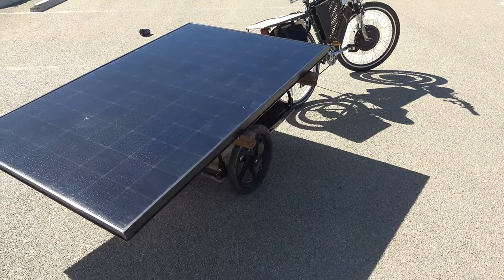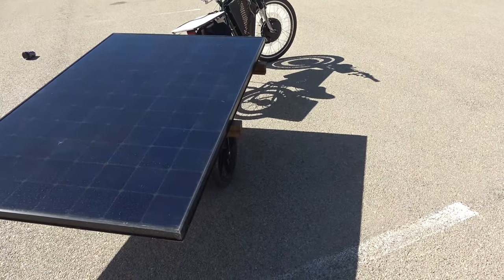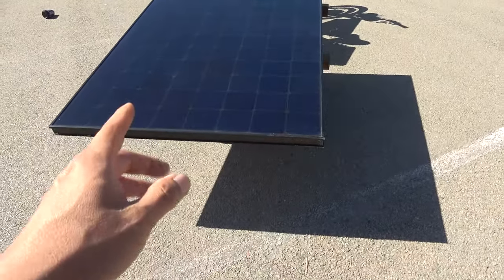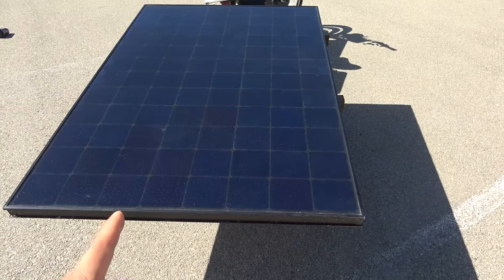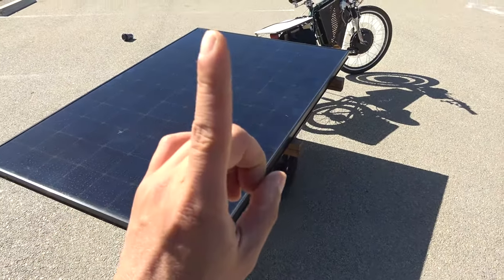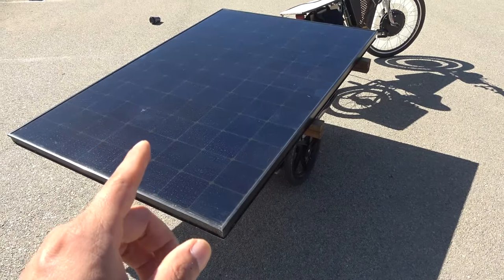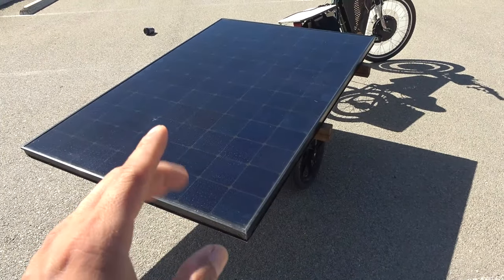It looks like I don't have enough power right now. It's end of October, almost winter, so the sun is at an angle — not straight overhead. You can see at noon the shadow is way off to the side. This panel usually produces around 300 watts in summer, but right now the maximum is probably around 180 to 190 watts. This might work in the middle of summer when the sun is right above your head, but this panel is already one of the biggest and most efficient I can get for this size.